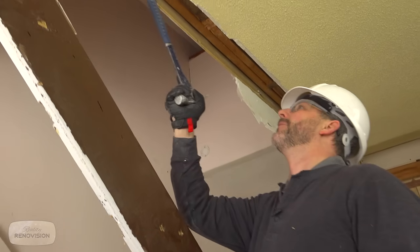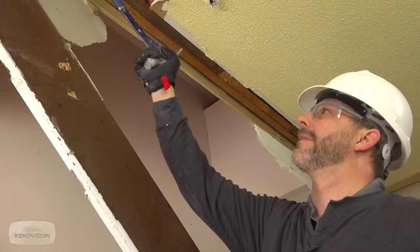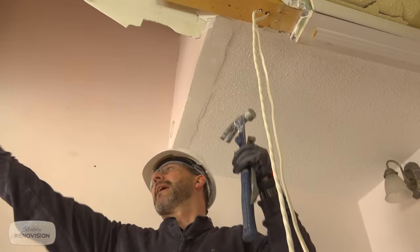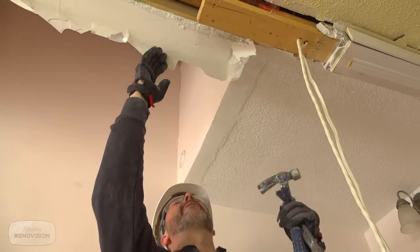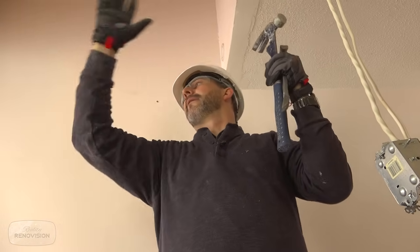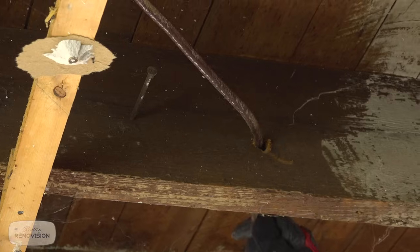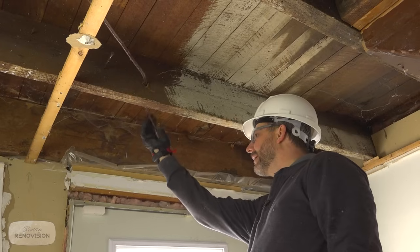I would say that this is a little too weak, especially since it's only nails. We'll end up having to put another 2x8 on there, get rid of this little nailing block, add some joist hanger, probably on each end. Oh yeah. So that 2x8 is just sandwiched in between the two, picking up one, two, three other joists. So almost half of this house in the middle here is being carried by three nails on that side and three nails on this side. No joist hangers. Wow.